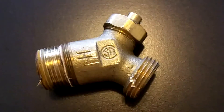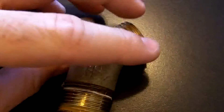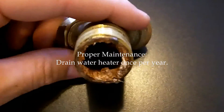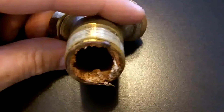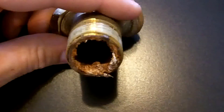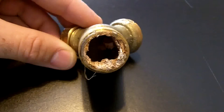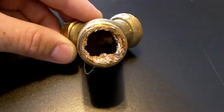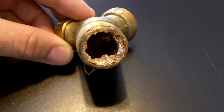This component is found at the bottom of the water heater and its main purpose is to drain water from the unit. It is highly recommended that all water heaters be drained once per year to remove sediment and debris that has collected in the bottom. If not drained, this sediment can aggressively attack the glass lining, causing corrosion that penetrates into the steel tank, leading to rust and leaks. Additionally, sediment caked onto the heating elements acts like an insulator, preventing heat from radiating properly into the water. The heating element is then forced to operate for extended periods, causing premature failure.